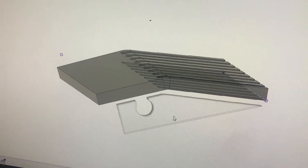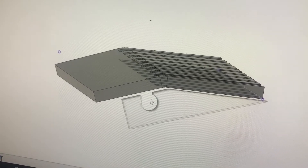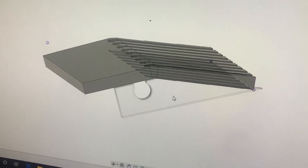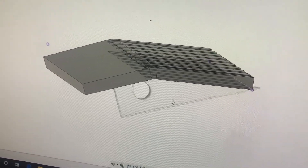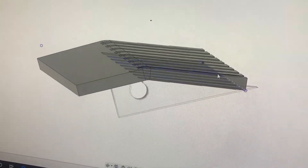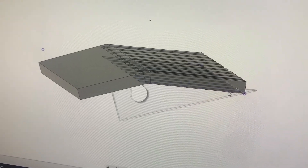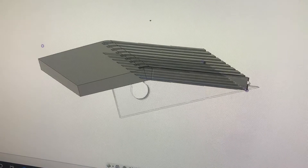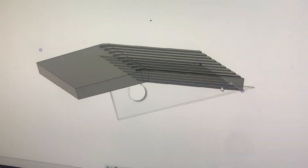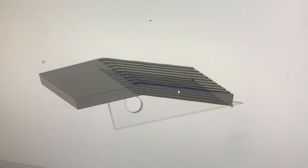Here are the other two pieces. This one goes on the other side of the stomp grate and will hold the bar that all of our bars are hinged on. It's going to get welded with a couple different pieces on the bottom to hold the bar, and then each bar is going to be individually set in these grooves. This piece is going to be cut and blended so that it matches the slope of the intake, and when you kick it, the bars should move up and down in these little slots.